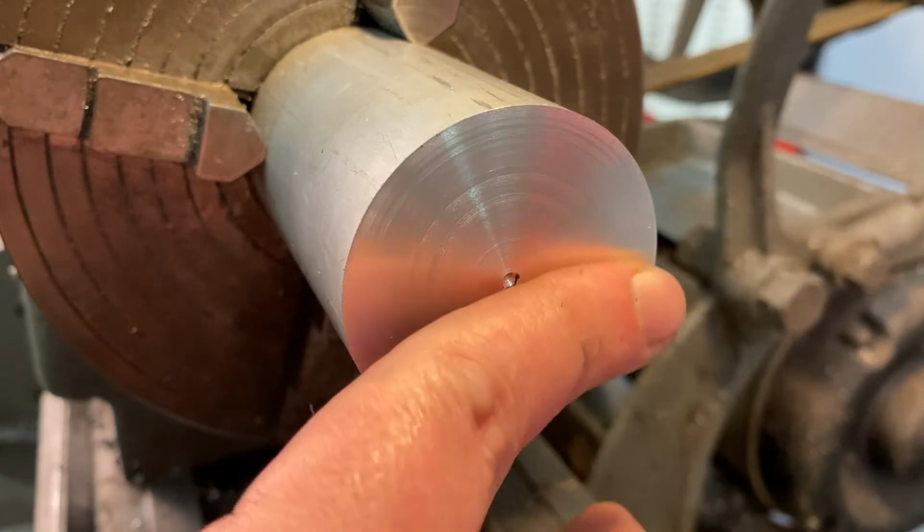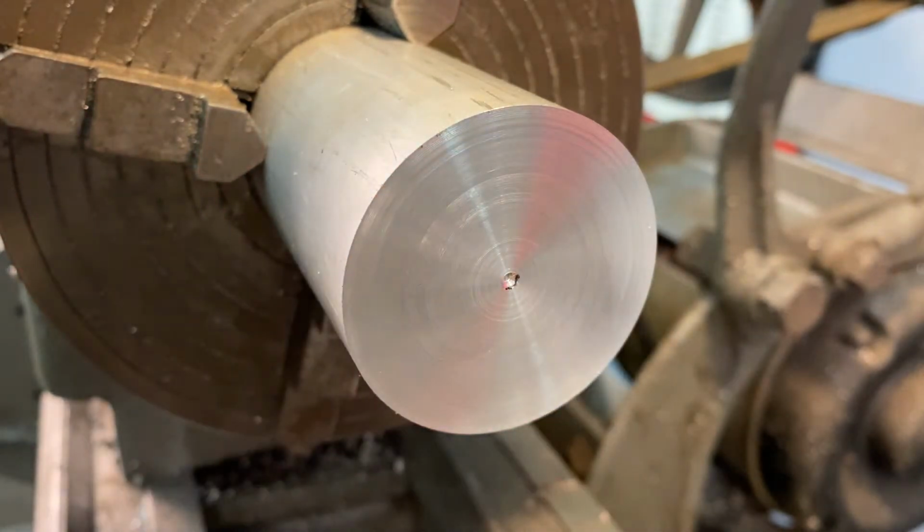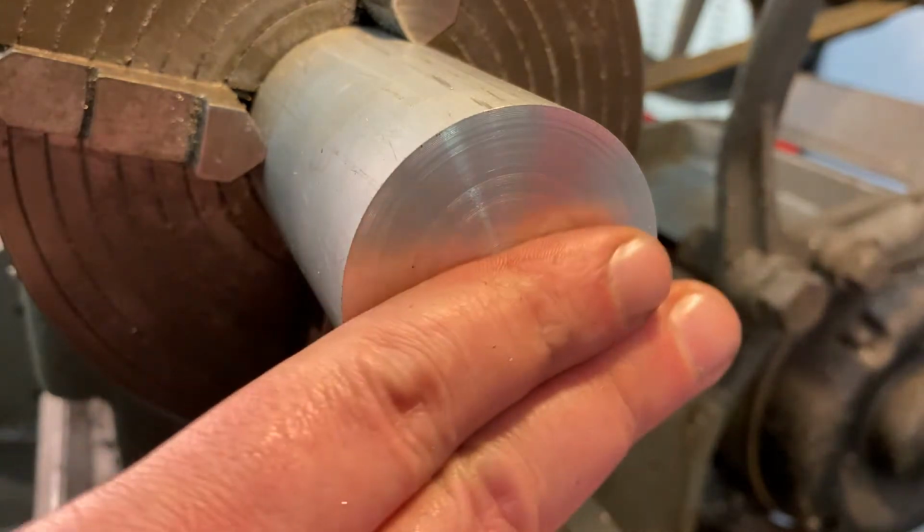It is so smooth. So what helped was going slower. I used the same bit. I just went slower, and I didn't even change that angle. I did change it during the first pass. We did that first pass, and it felt kind of rough, so we changed that angle. And then we did our second pass, and that felt really good. And then I went ahead, went slower, took off less material in what is called a finishing pass. And that smoothed it up really nice.